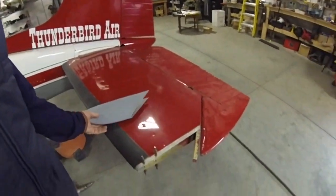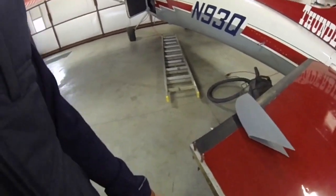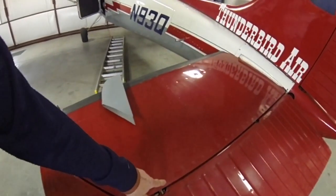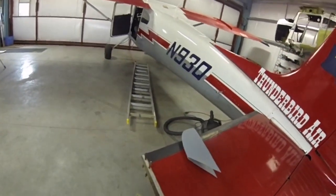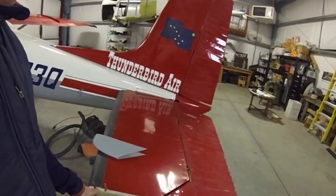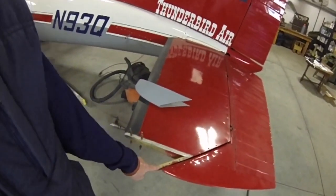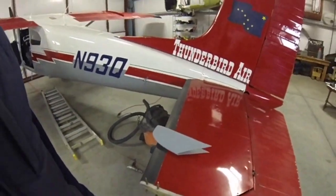You can see I drilled out my elevator tip here. I'm not the first person to be in here, you can kind of tell — there are a couple different size rivets here, must have been repaired somewhere down the road. I'm going to install nut plates and 8-32 screws down here, so the holes will open up and I'll put some nut plates in there.